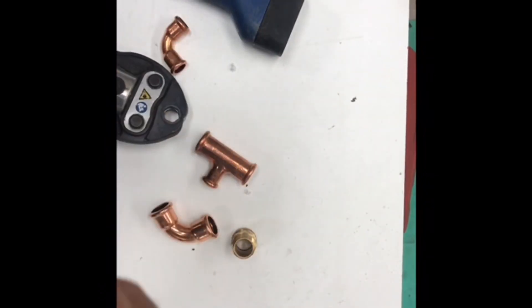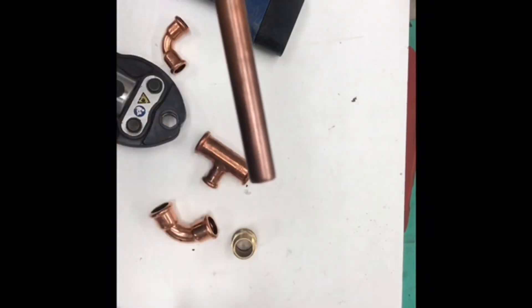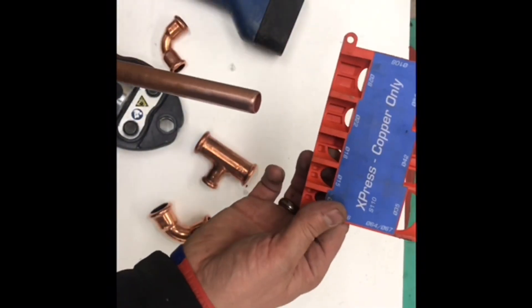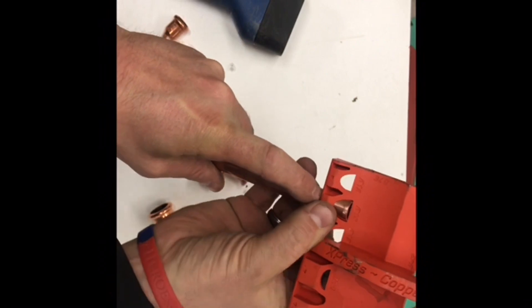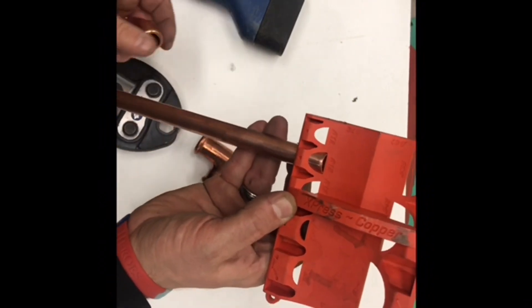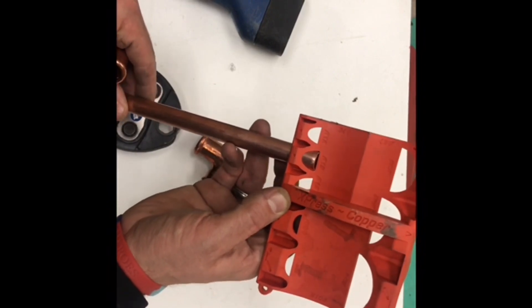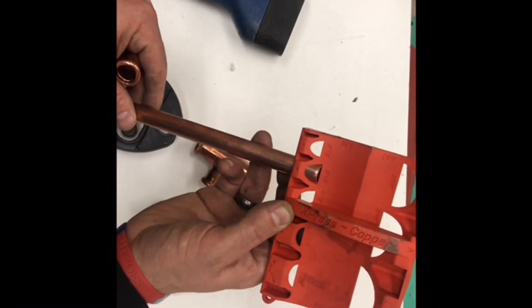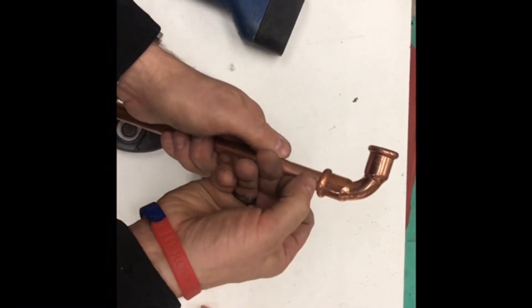Normal cut with a pipe slice. There is a reaming tool to take the burr out — they recommend you do that — and then you need to scotch bright it, clean it all up, and check the end of the pipe for any major scuffs, dings, and dents. Then you take this depth gauge, put it in there, and mark the depth with the proprietary pen. I'll be honest — this just doesn't get done on domestic jobs; commercial jobs it will because to get it signed off for warranty they have to be identified. You should do it on all jobs. We don't, but we've never had one leak yet and we've been using it for five years.